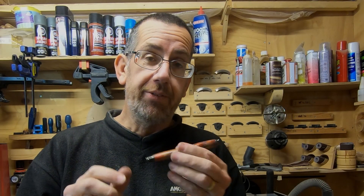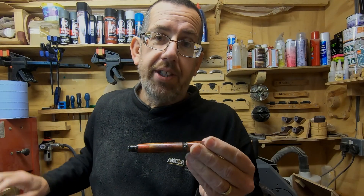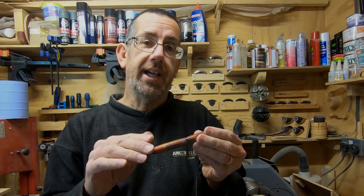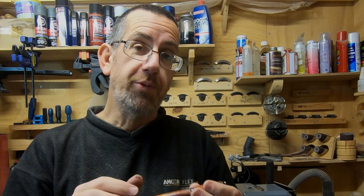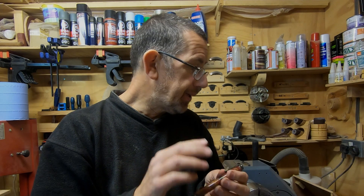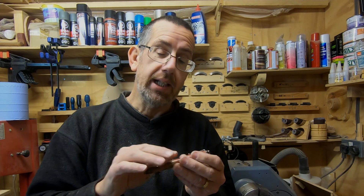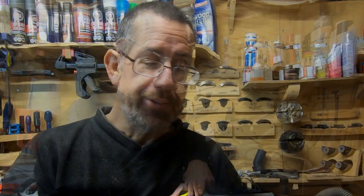This pen I'm super pleased with — really pleased with the way it came up. The finish on this is a lot better than what I did on the first one. The difference is that when I did the colors I left them overnight to fully dry, put on about three coats of sanding sealer in the spray version, then when I put the melamine lacquer on, the first coat did bleed a little bit of color — and that's where it's retained the colors the way they were.